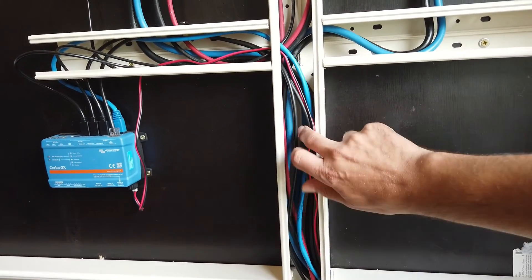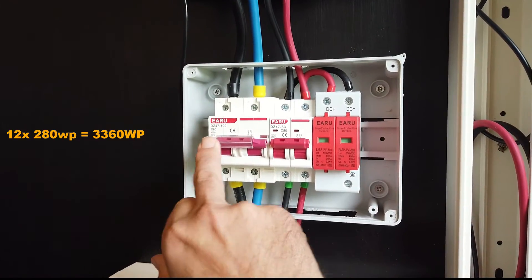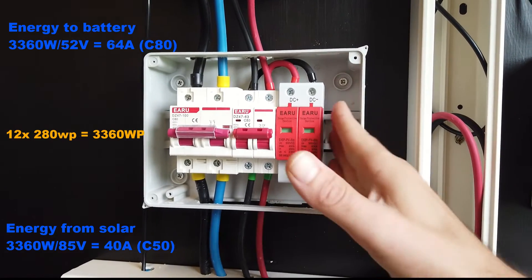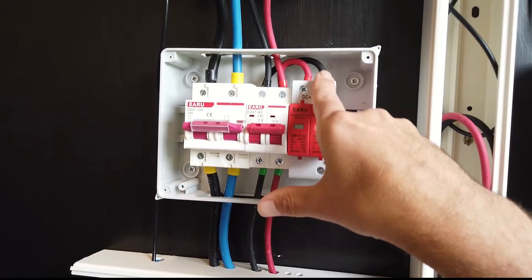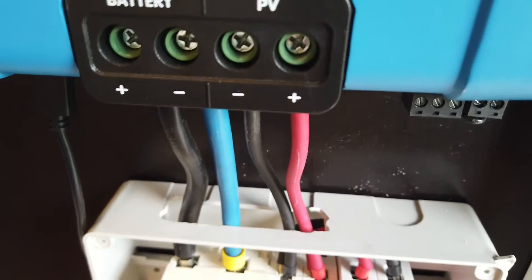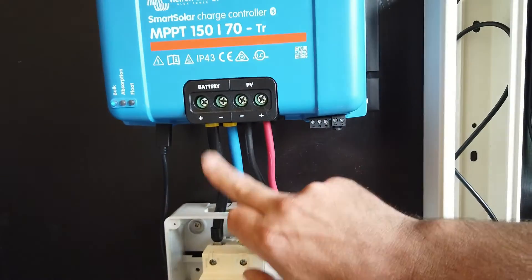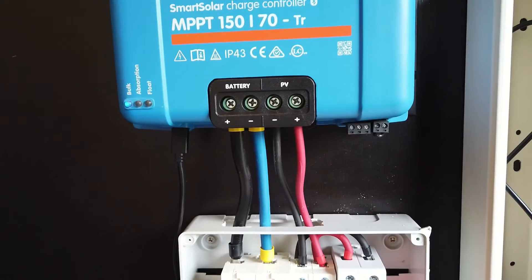I'll show you the path here — the larger cable goes to the breaker. Here you can see the Victron C80 and C50. This is the surge protection device. If something happens — lightning or so — this will protect, or should protect, all the devices from the surge. As you can see it's connected with the solar. I had to open the box at the top and at the bottom; I used a jigsaw for that. I first started with installing the cover and then made the smaller cables. That's a bit of a challenge — they're pretty short because they're pretty stiff, they're 25 square millimeter and it's not easy.